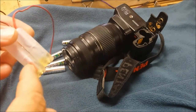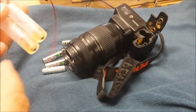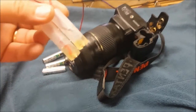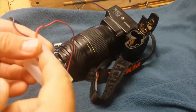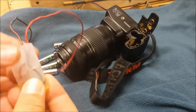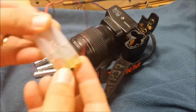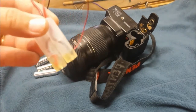Then I used some plastic epoxy — I didn't have any hot glue — and basically just filled it down in there to keep it from coming out if my solder job isn't great. I drilled a hole in between the two so I can run them together. Once I'm finished I'll glue it together at the right height, but just for testing I'll leave it as is.